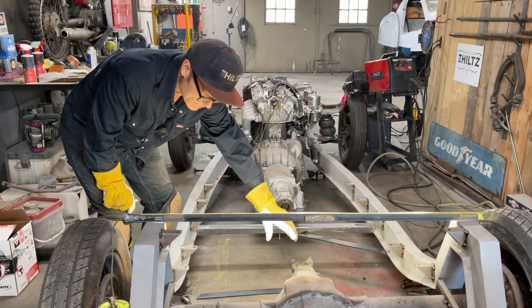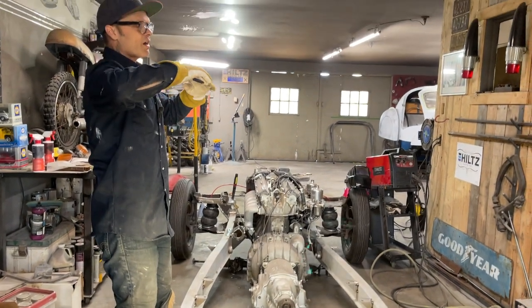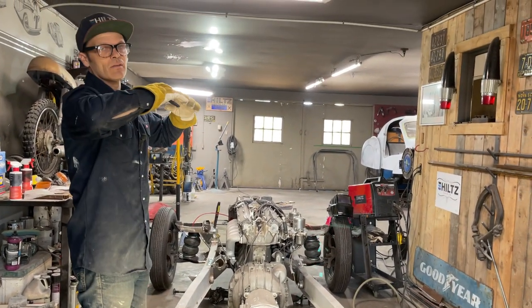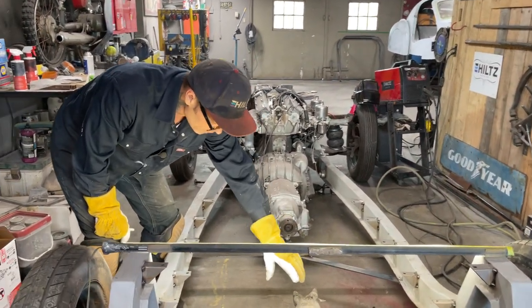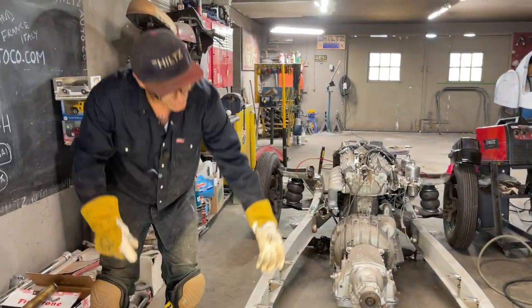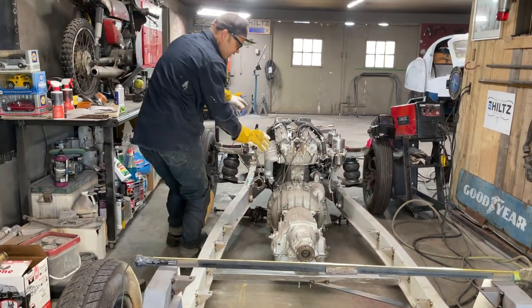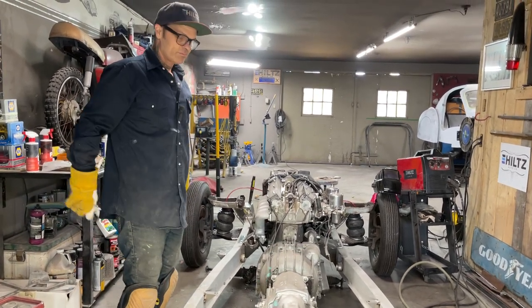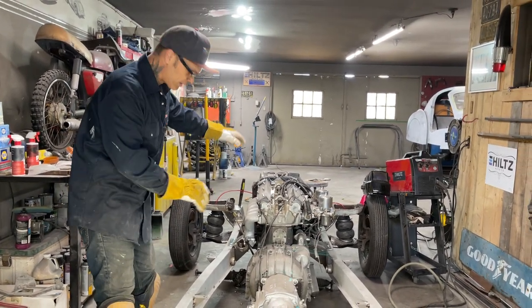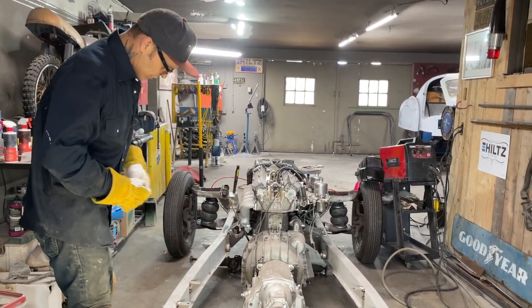And the rear end, when I do the rear end, I do it level. And then I turn it down just a little tiny bit, just because when you step on your car, first thing your rear end does is go up, basically. So I generally just put it in level, and then I just eye it up, and I just turn it down just a little tiny bit, just like I lay the engine down, just a little tiny bit. I generally don't degree it and make it difficult. I just lay it down a little bit, turn it down a little bit, and generally it works out.